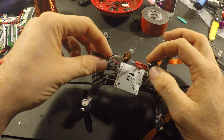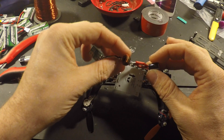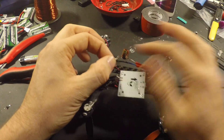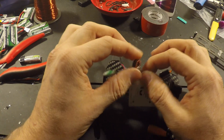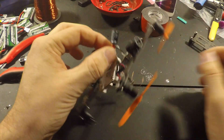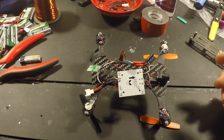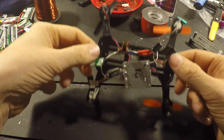So this is where I was having my problems. I could not for the life of me get the LC filter set up to work. I came in today, spaced things out a little bit better, sat down, remade the inductor — made my fingers hurt afterwards, but it looks pretty. Goes right into a 16 volt 470 microfarad capacitor. I have no rhyme or reason — it's what I read online, so that's why you have that.